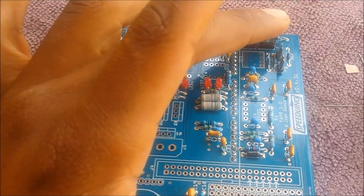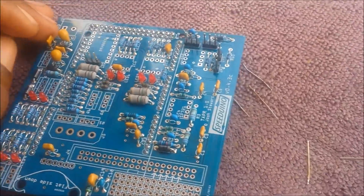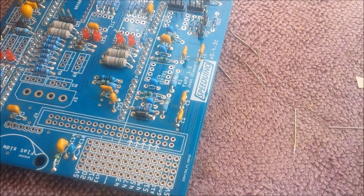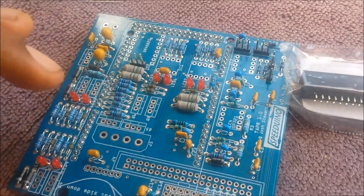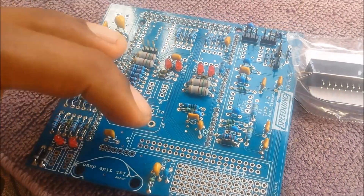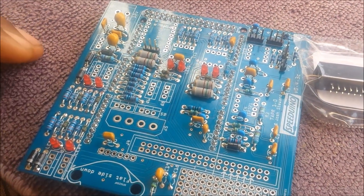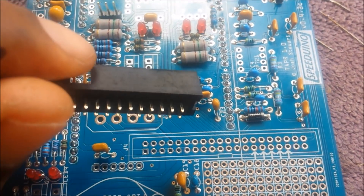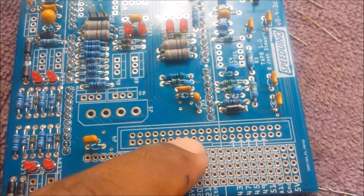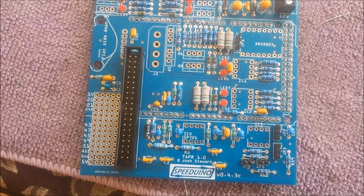The pin headers for the jumpers are soldered up and those at the bottom are done. Next step we're going to do the screw terminal for the power and ground and the IDC connector. Some folks choose to solder wires directly to the board — if you're planning to just put wires in there you don't need to put the IDC connectors. The IDC connector has a slot that matches the white box marking on the board.